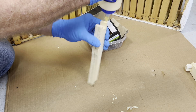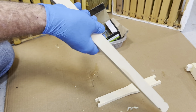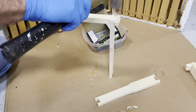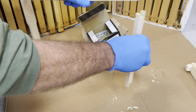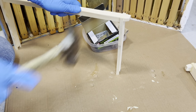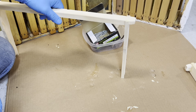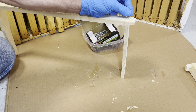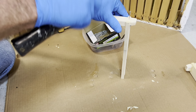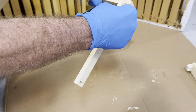Once again, apply glue to the upper sides — it's easy to do both at one time. Attach the side to the top, making it secure and bottomed out onto the side until it's good and snug. If you do one side first, you'd have to hold it the whole time. Notice it just stands by itself, and you can drive that nail straight in. If it gets a little sideways, just straighten it back out, and wipe off that excess glue.